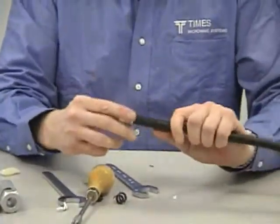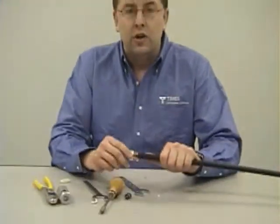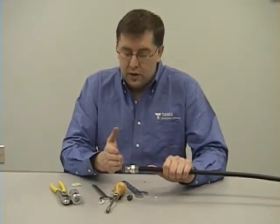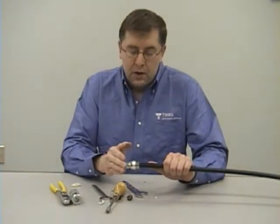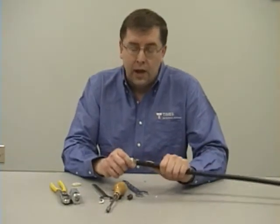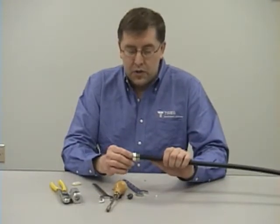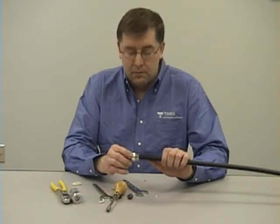And what you've done is you've terminated the cable very quickly with a very good low return loss connector, and it's done in such a way that there's very few variables in the termination process. You didn't have the chance to melt the foam with a soldering torch. You don't have to worry about crimping it in the wrong place, over crimping it, using the wrong crimp die. You don't have to worry about pin gap. You don't have to worry about pin height. All this has been cut out of the equation. So it's something that you can get a very good performance with every time and have a lot of confidence in. Thanks a lot.